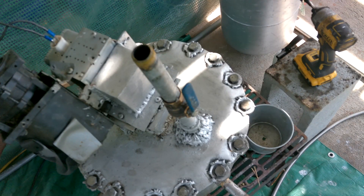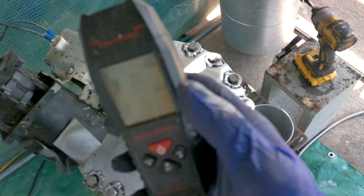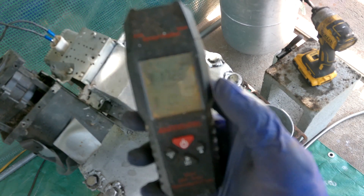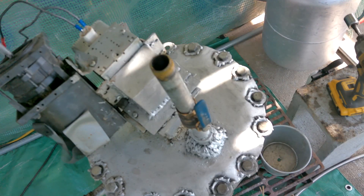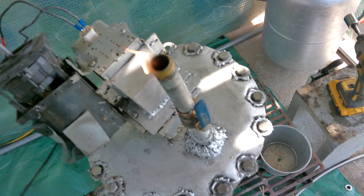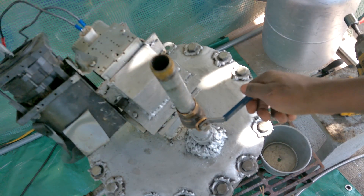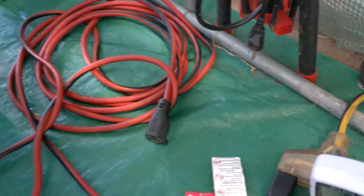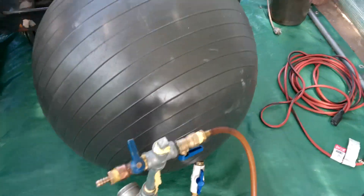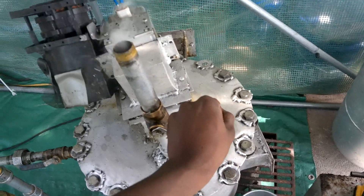There are some things that don't need a catalyst, but I think that when you do microwave pyrolysis you should add a catalyst to everything. I just turned this back on, we got the microwaves forming, and already we pretty much have vapors forming literally just seconds after starting it - flammable. It's a complete difference. It's just a lot more energy efficient to use this, because even though the grass was absorbing microwaves on its own, it just wasn't that good. After about an hour and 40 minutes, the yoga ball is completely full of grass gas. It's pretty clean stuff.